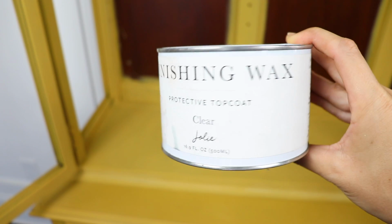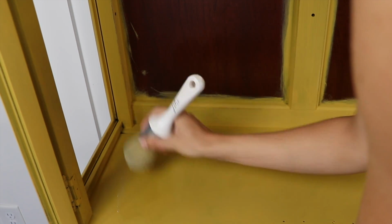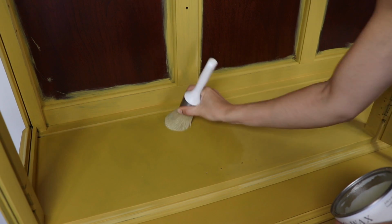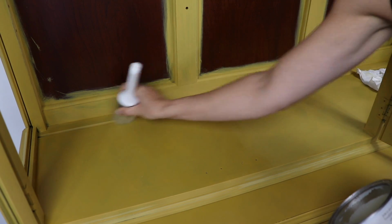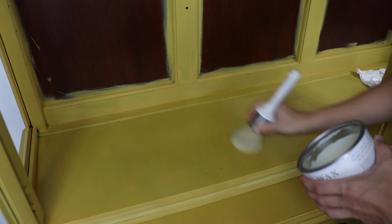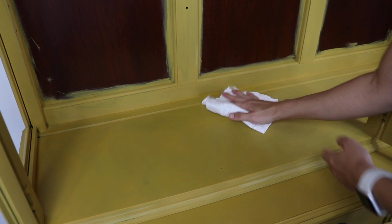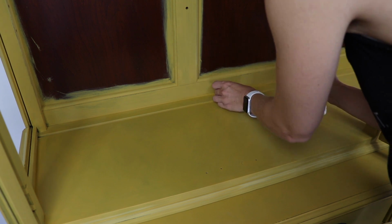I'm going to be using the Jolie finishing wax in clear and my large Jolie wax brush. This is the same sealer that I used in that first piece. I love how this wax performs over this paint. If you guys watched my video where I compared all the Waverly paints and the top coats, there is something about this Waverly chalk that the paint kind of pulls up as you're working with it, and I find it does it less with this wax out of any other top coat. And it really deepens up and makes the color really rich and beautiful. And the buffet has held up really well having this wax on it. So I'm loving this top coat with this paint. And I'm just going in and wiping it back with my lint-free Intex rags that you guys see me use on my channel all the time.